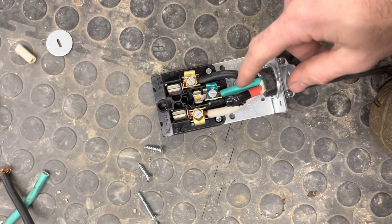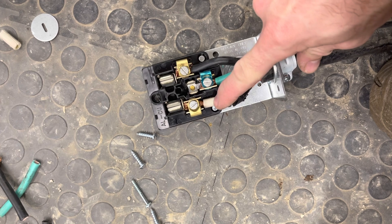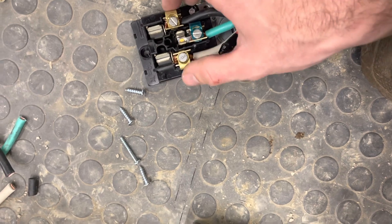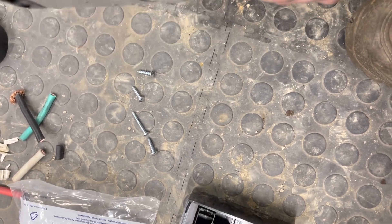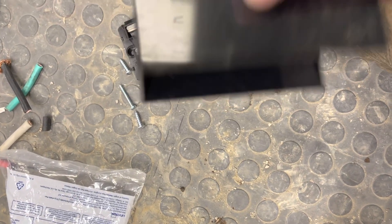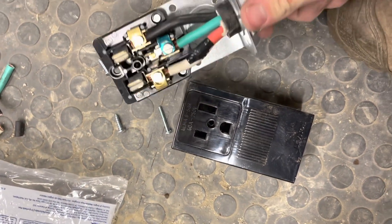So here we have it. I have the red wire cut and taped off. I have the black, ground, and neutral white fitted correctly. The set screws are really snug down. Overall that looks like a really clean install. It's really sturdy. It looks like the box just gets mounted with one screw right through the face, and it looks like it came with a couple screws if you wanted to mount it to the wall. Overall that looks really sturdy.